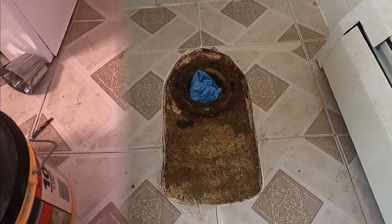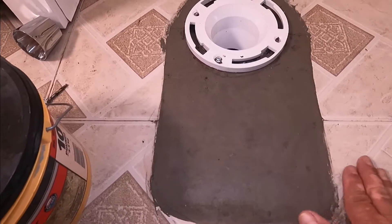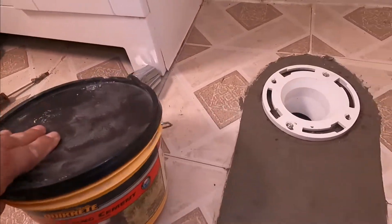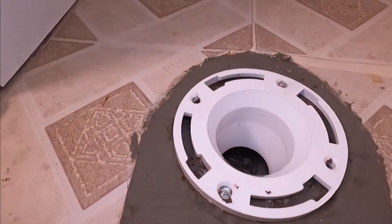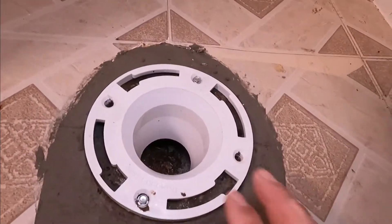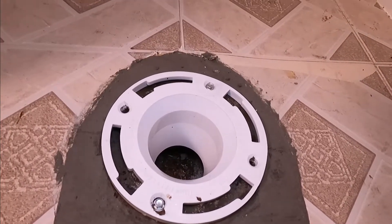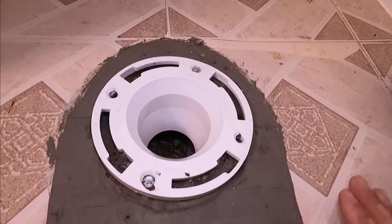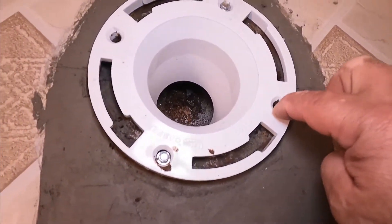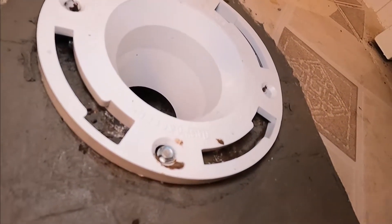I patched my floor — remember, it was a quarter of an inch below the surface. I chose this quick-setting cement; it takes 10 to 20 minutes to dry. I also fixed my flange. I put an extender for the flange — this is about 3/8 inch — because my cast iron flange was sitting 1/8 inch below. You want the flange to be on top of the floor. What I did is drilled through the holes and put screws in — these are one-inch self-drilling screws.